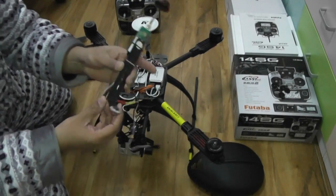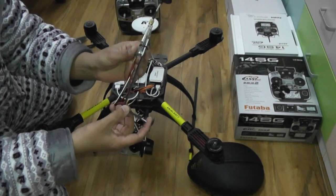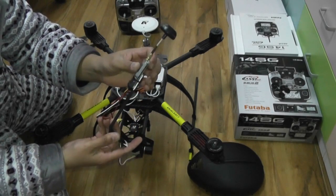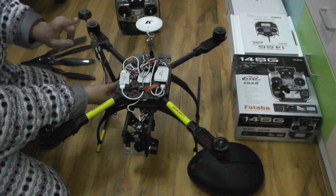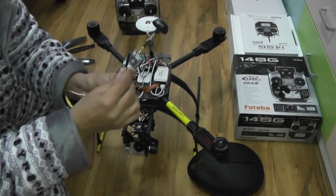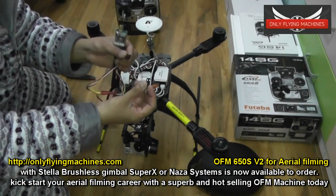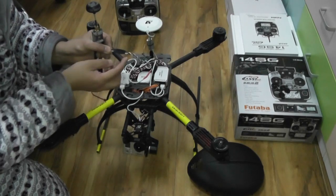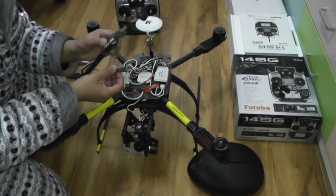I would suggest you find something like a DIY platform — I made mine using an aluminum bar from my RC junk. Mount the video transmitter on top of it and stick it on the side of the quadcopter so the antenna sticks up high, which is very good for reception. The video transmitter will have a cable with a connector. Your video out from the OSD will simply plug in — make sure the polarity is black to black, white to white — and it gives the video out to the video transmitter, which will transmit the video to your ground station.